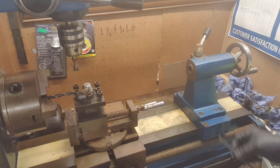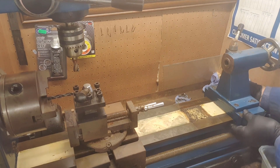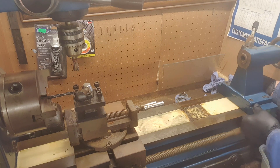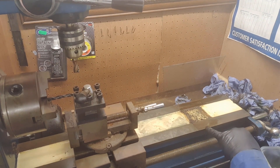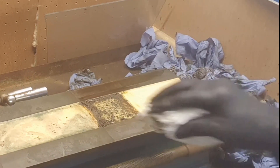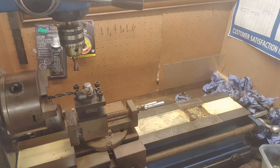That one's loose already. I'll just be cautious of these gibs because they might fall out - and there it is, that's off. I'll pop that somewhere safe and have a look at the lathe bed. We can see they're quite oiled up, these ways. Yeah, I'm very happy with that - the oils have protected that part of the bedway.